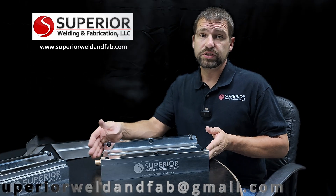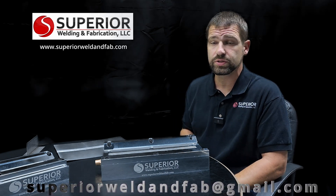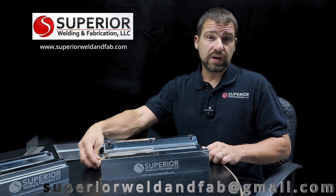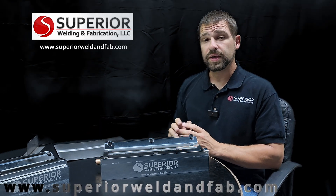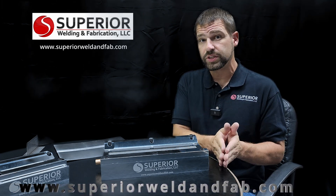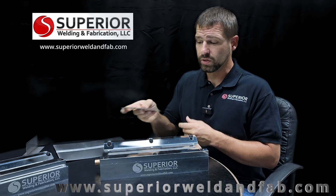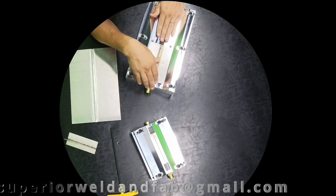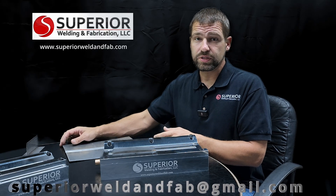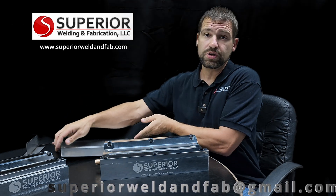For those doing welding procedures, we have our 14-inch hold-down that allows you to do 12-inch long coupons. These are for shops starting fresh with D17.1 that need to do their welding procedures with larger plates. About four or five years ago we found the need to offer a second, larger fixture. One thing to note: if you're going to do both your procedures and your welder qualifications, this one fixture will do the job. The pocket machined in these blocks is 12.5 inches long, allowing you to do full 12-inch welder qualifications with no problems.